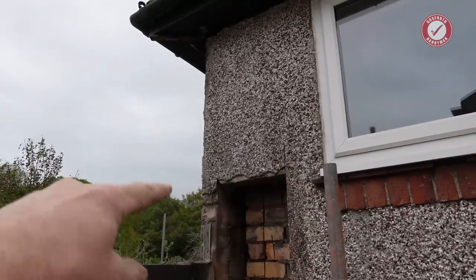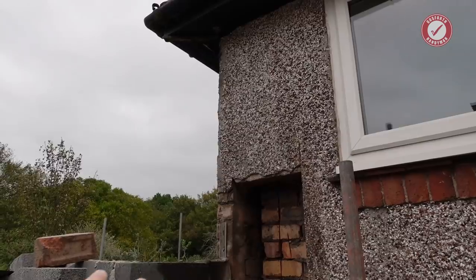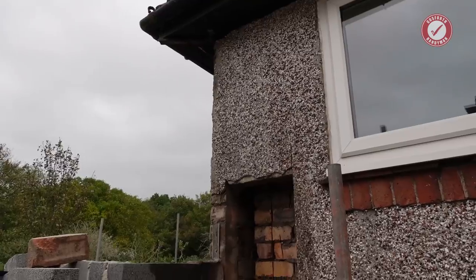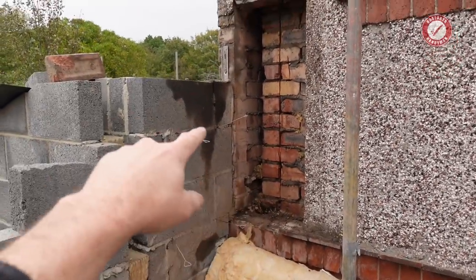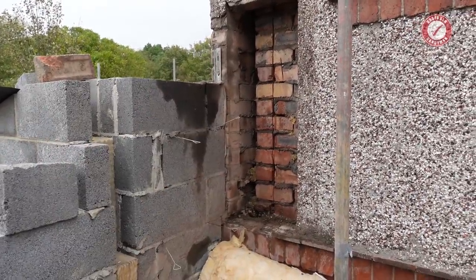And remember, there's a window going up there, so there's no point in taking the rest of that out. That'll come out once we've got the second lift of scaffolding on the other side, and then we can take the window out or the brickwork out from the top there. But there's no rush to do that at the minute. It's just in order to finish the stuff on the first lift, Alan needs to get up to this level here, so we need the wall starter installed on that inner leaf. So that's part of my homework.